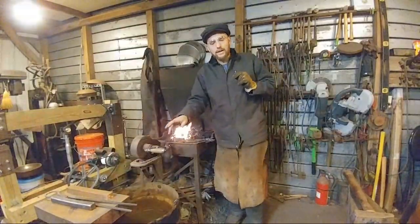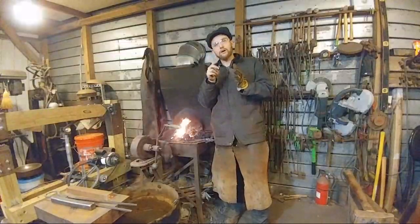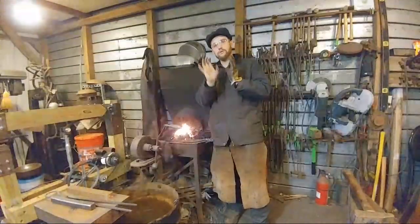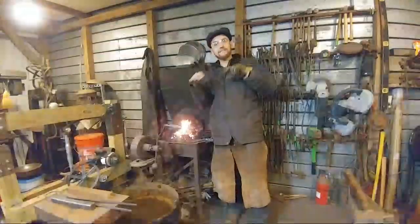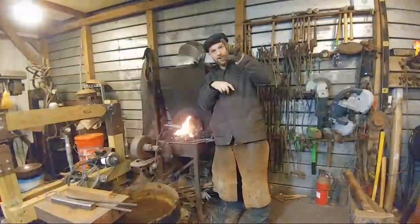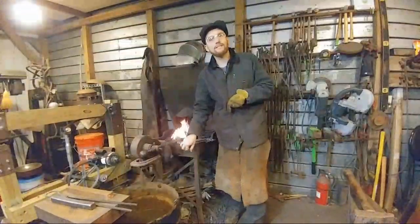But essentially what I do with my tongs is I figure out where my jaws need to be, and then I lay out my marks. Depending on how I lay them out tells me whether that's going to be an offset, like a shoulder where I'll use half on, half off blows, or if it's going to be a double shoulder. In this case of these tongs, it was nearly a double shoulder, so that's why you see the 2 marks on the one end. I'm defining where that double shoulder is going to be for the boss, to lay off the boss area. Hopefully that makes sense.